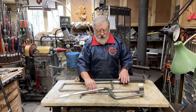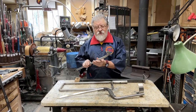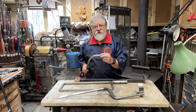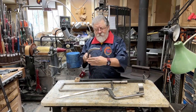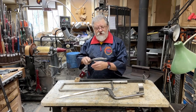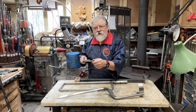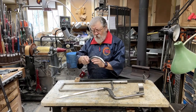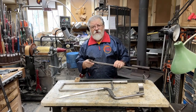The first one is hollowing out by hand. That's where you take a curved tool similar to this — it's got a hook in it, and at the tip is a high speed steel or carbide cutter. It goes into a handle. Your tool rest sits here and you go into the opening and you start hollowing out. There's a problem with this tool in that it could be quite dangerous. You can often get a catch inside the piece which will twist it in your hand. Sometimes the catch is so violent it can break your piece or twist your arm and cause some damage.